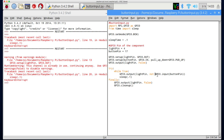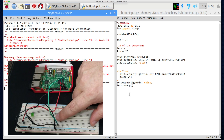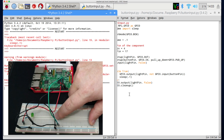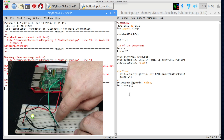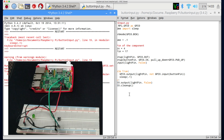We'll save that off and run it. Not only are we not getting warnings because of the cleanup from the last finally statement, but when we press the button the light goes on and when we let go the light goes off. We're almost setting up some Morse code — except we'd need to adjust the sleep timer, since right now the fastest we could blink is a tenth of a second.